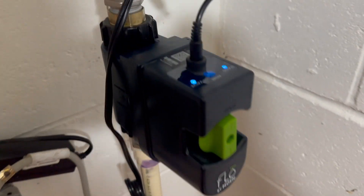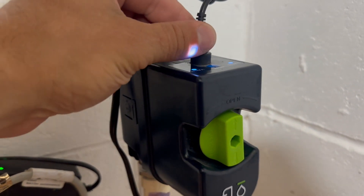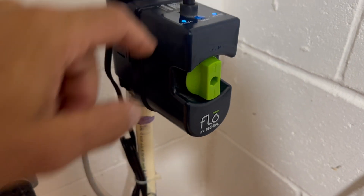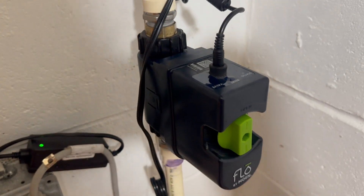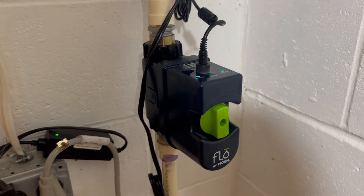When you reconnect the power connector, make sure it seats all the way down and the lights come on. Sometimes it seems like it's in but it's not all the way seated. Before you test the replacement, make sure your lights turn on, the unit reboots, and it connects to your Wi-Fi. Now that we have both lights green — the valve and the status — go ahead and pull up the app, turn on some faucets, and see if we have actual flow. We are back up and running — successfully measuring our flow again.